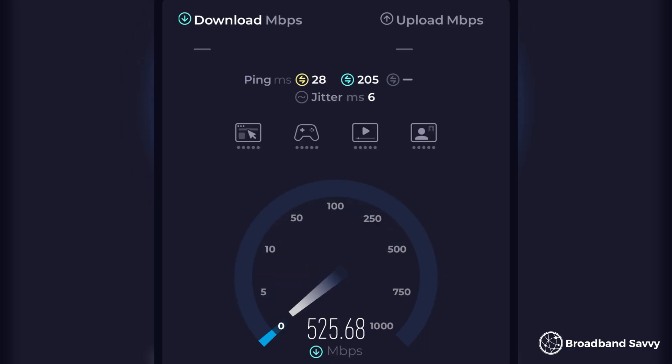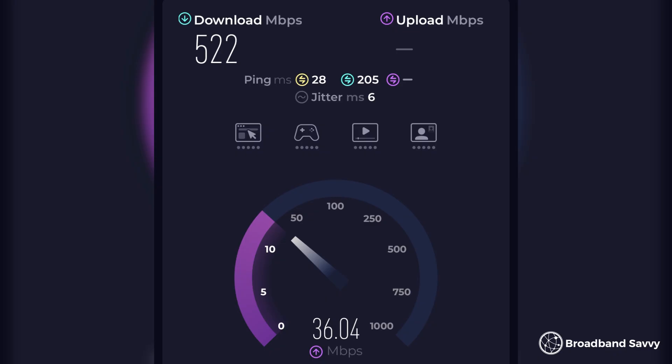With the antenna installed, we generally got much better speeds — about 550 to 600 megabits down, and an upload speed three to four times as fast, which is really great to see. Positioning the antenna is a bit tricky; you have to fine tune exactly where it's pointing, which is fairly easy with the mounting equipment included, but does take quite a lot of different speed tests to work out exactly where best to point it. This is even true in cases where you know exactly where the mast is and it's really close to you — we can actually see the mast from our house, but found that a fair bit of calibration was needed to get these really good download and upload speeds.